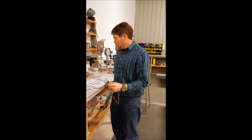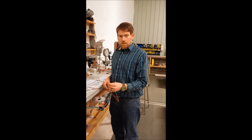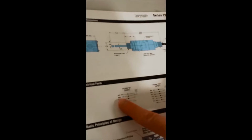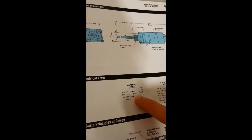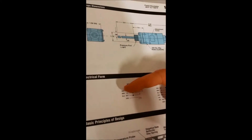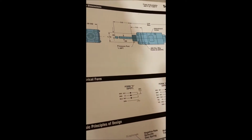Nice to meet you. Just doing a demo here with one of these temperature switches you returned to us. So Amy, if you'll zoom on in here, we'll show you what we got. According to the diagram, brown is our common, and when we're actuating back and forth with the switch switching, it should be red and brown and blue as it actuates, with brown as the common.